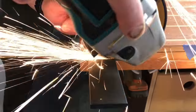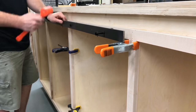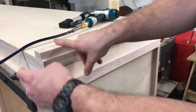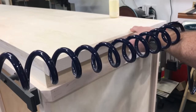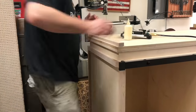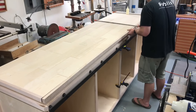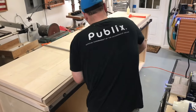After making some cuts and getting these measurements just right, I'm finally finishing putting on the track. Putting a few squeeze clamps to give it somewhere to rest — definitely a good idea. Now I can focus my attention on making the trim for the bar top. Just glue and brad nails is all that's needed. Anytime I install a piece of trim that's over 10 feet long like this, I go ahead and clamp it in place as I start to work my way down, brad nailing it in place.